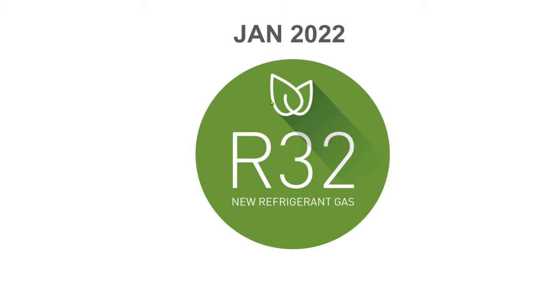Let's do a quick overview of our system. Our unit is a monoblock unit, and what that means is, when you have a typical split system, you have a central air split, or a mini ductless, or a central air cassette, etc., you have two components. You have your indoor component, which looks like this, a wall hung unit, or your central air unit looks bigger than this and goes to ducts. And then you have your outdoor condenser unit.